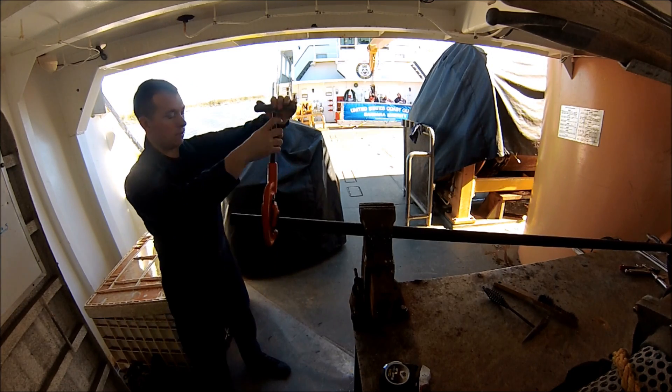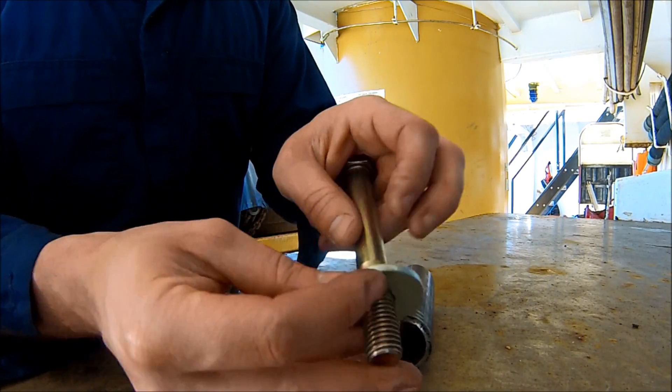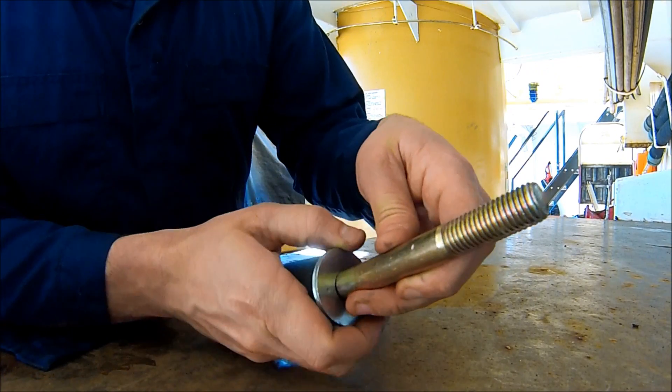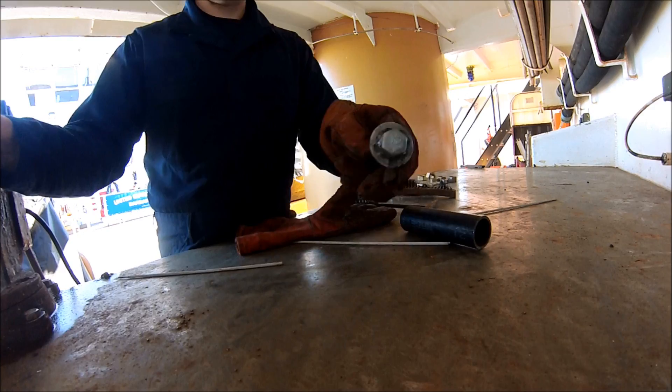Right here I'm cutting off the back section for each peg — I'm going to do this twice. The way we're going to have the back bolts, we're going to thread it through the washer. We're going to weld it on to the back tube. Right here I'm welding the washer to the bolt to have that back spindle.